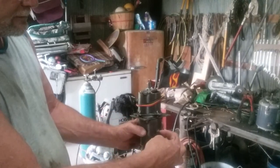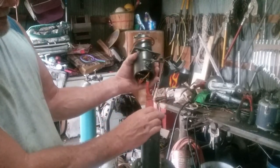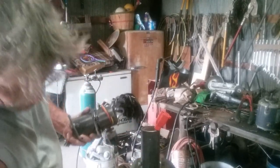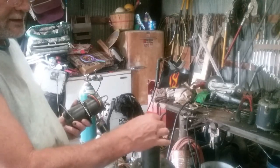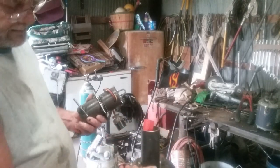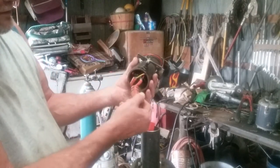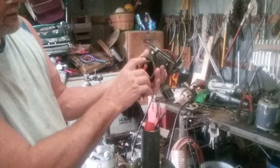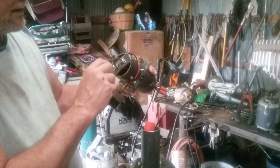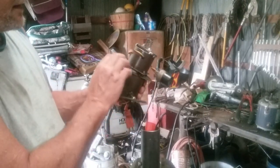The swivel assembly uses a bigger piece of the same pipe. I made an extension cord short - it goes from the bottom of the pipe up to here. There's a bolt through here to keep this from dropping down so I don't ever lose it. My wire nut connections and electrical tape stop this from dropping. On this end I have another cord, male, that goes up inside here to a bearing, and inside the bearing is the electrical swivel piece from Amazon.